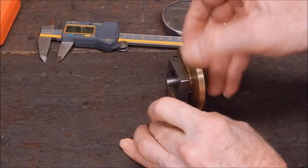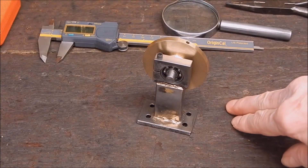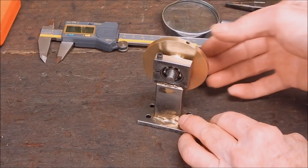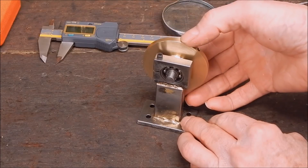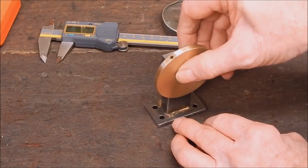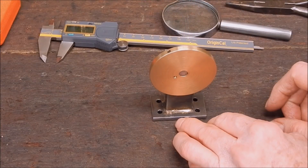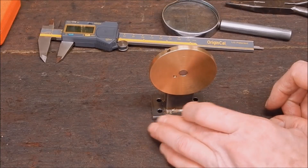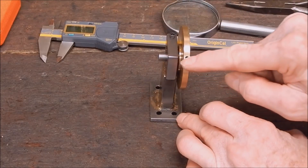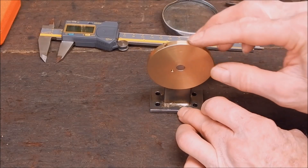The whole thing is basically pretty simple. I'll have a smaller flywheel on this side for the power piston. The displacer, being heavier, has got the bigger flywheel on that side. To try and do this without something like the Hilda rotary tool and the tool post would be damn near impossible — you're drilling a very narrow margin and you have to go through 30mm. Did it, no problem whatsoever.